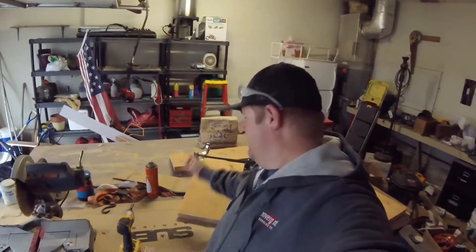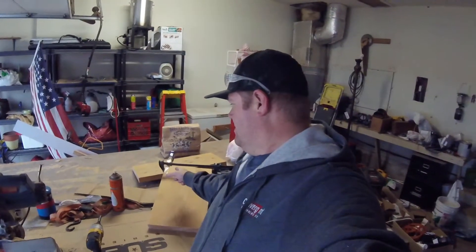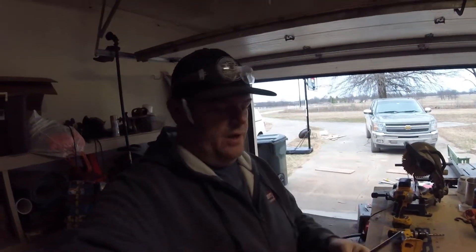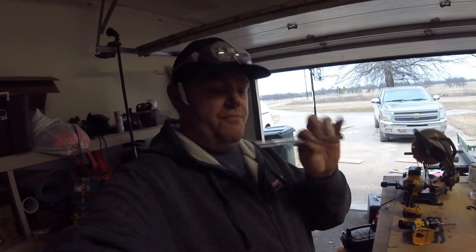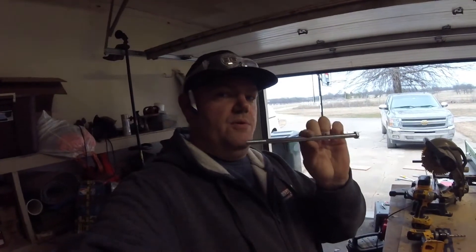I had one little mishap with some pretty bad tear-out. I'm not sure what's going on — I don't know if my saw blade's bent or what, but I don't have time to check it out right now. I kind of made my way through it, but that's why I'm gluing up. You shouldn't have to do that. Next step is laying out where your rods are going to go — this is actually what's going to bear the weight of your shelf. These are 3/8 by 8 inch rods. I'm going to lay them out on the board. Your size could be different depending on your shelf; mine is a 2x12 shelf. If your shelf is not that deep, you don't need 8 inch rods. I'm just trying to get as much support throughout the entire shelf as I possibly can.